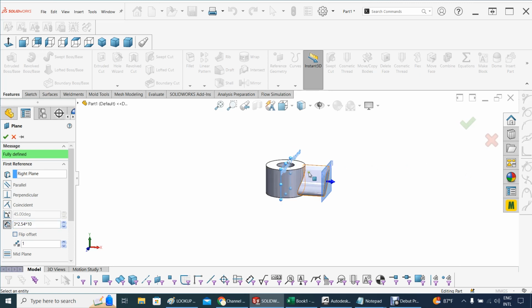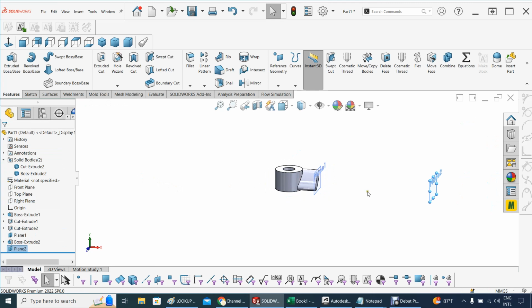So in terms of angle, this hub here has the highest root at 45 degrees, and then I'm thinking that from here to here, when I connect, that angle will drop to 30. So let's do that at basically 3 inches. So we're going to construct that plane at 3 inches from the center. So we accept this, and that's what we have, 3 inches. Now, remember, the last is to construct another plane, which is going to be at the full 6 inches, because it's going to be 6 inches down here and 6 inches down here for the 12.